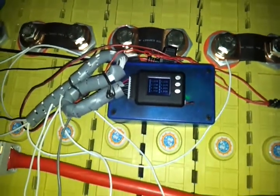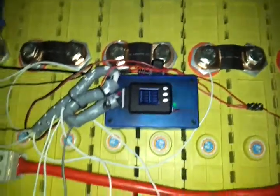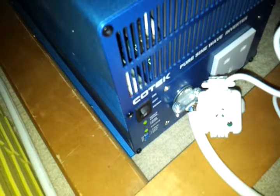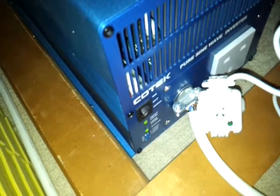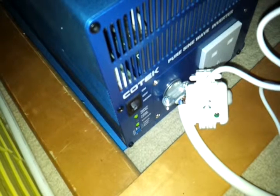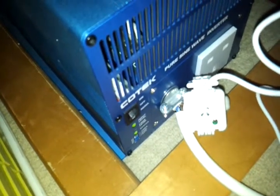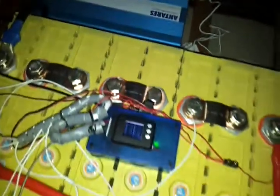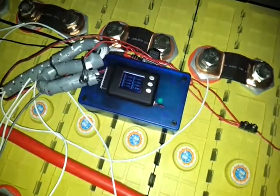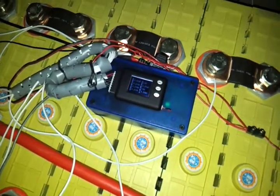So that seems to work and we'll just plumb that into the switch on the side of the inverter. There's a three-way switch: off in the center position, top is on, and the bottom is remote. I'll open up that panel and wire this relay as an enable or inhibit signal into that center pin on that switch, so that no matter what, the inverter will turn off or stay off if the alarm is triggered. Oh yeah — the fridge came on and it's triggered the alarm again, so it's gone off.